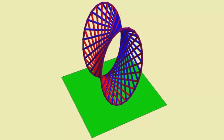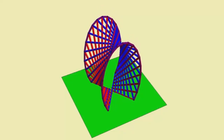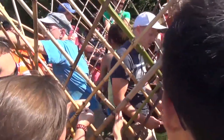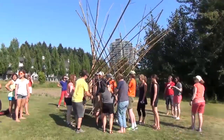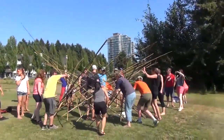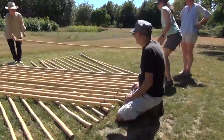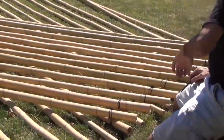Our plan is to proportion it and sink it into the ground to make an arborway for people to walk through. We'll practice with some scrap bamboo to get a sense of the engineering challenges at full scale. Flexing this model is fun, but we see we'll want to brace our structure so it doesn't flex. For the full scale version, we first decide how many lines we want — placing 24 pieces of 12 foot long bamboo in each direction, making two families of diagonals.